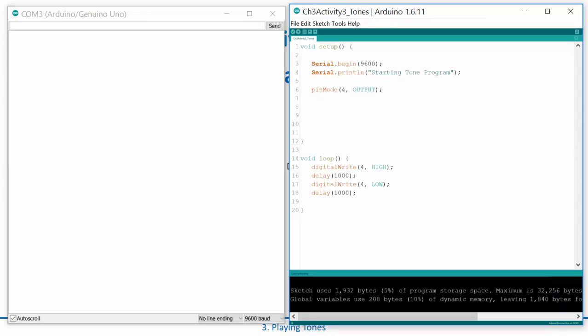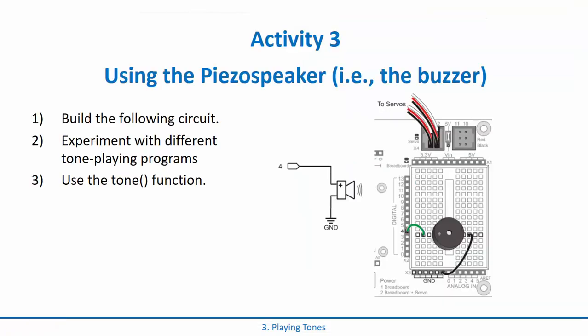I'm downloading it and it's starting the program. You'll notice it's clicking — just sitting there going click click click click. What's happening is that material is flipping one way and then flipping back, but it's going at a very low frequency. It's moving back and forth so slowly that all we hear is clicks — it's not really creating a tone.